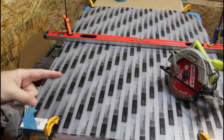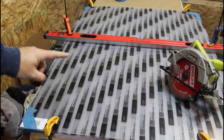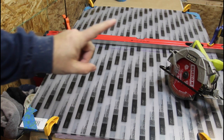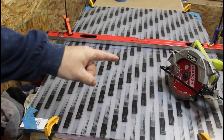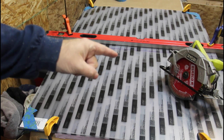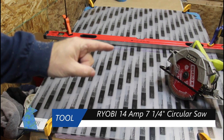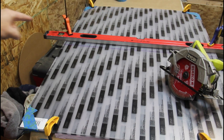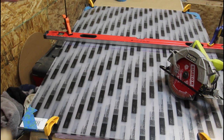This is five sheets of eighth-inch laminate — they're stacked and squared against each other. There's a purple line that's exactly at the 24-inch mark, and the width of that line is the center, which coincidentally is the same thickness as that blade. It's a special Diablo blade for laminates, acrylics, and even aluminum — I'll have a link to it down in the description. I'm using my Ryobi corded saw with a four-foot level squared and clamped down as a guide. It's supported by poly foam so as it cuts through it doesn't cut the table and doesn't bow or bend as I'm cutting it.